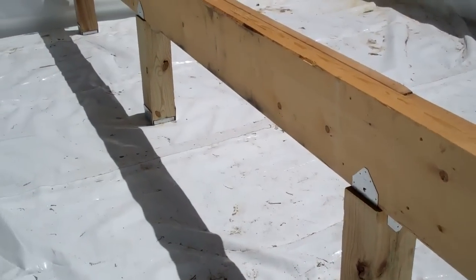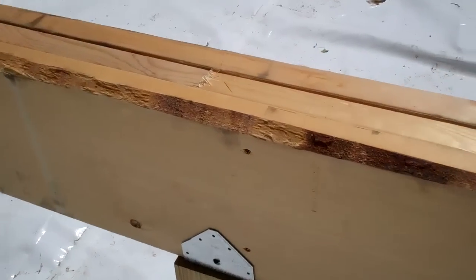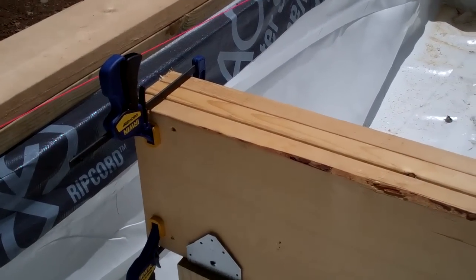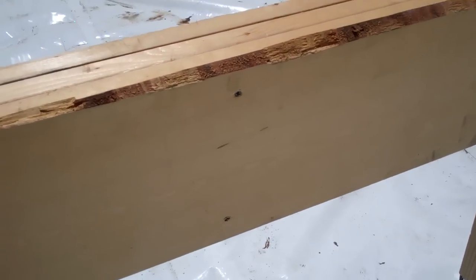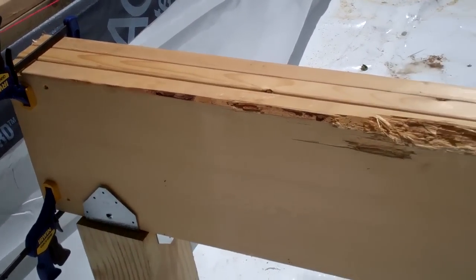So far I've got the girder in place. I've got joints located over posts — like that middle joint there is located over the post. I've been using clamps to draw the wood together as I've been going, and then sinking some screws to hold the wood together. Now I'm going to go back and spike it with nails.